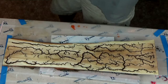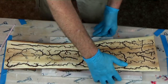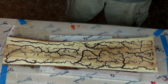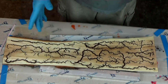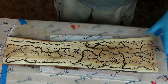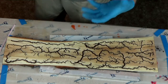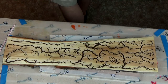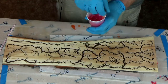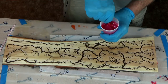Anyway, that's what it looks like right now, but it ain't going to be what it looks like here in a second. Back in the studio. One thing I forgot to mention — this wood is so soft that if I put epoxy on it, it's just going to soak in and stain the wood really bad. You don't want that, you want the epoxy to be here, not out there. So I hit it with some bullseye shellac and let that dry. What that does is it seals the top, makes it easier to sand and keeps the epoxy from soaking into the wood. I have mixed up a little bit of magenta — I think it's going to look magnificent.